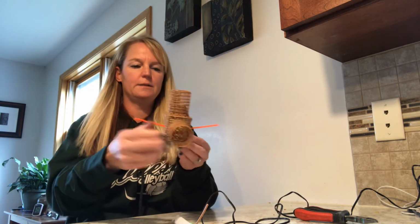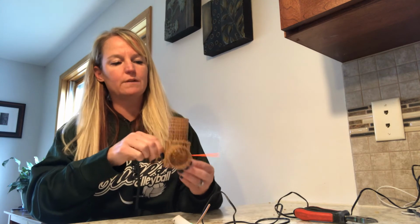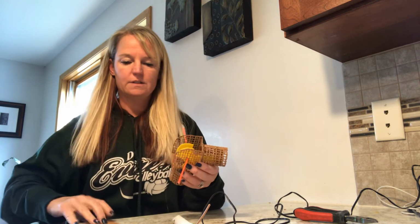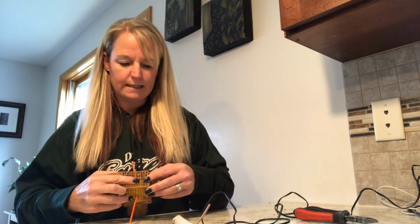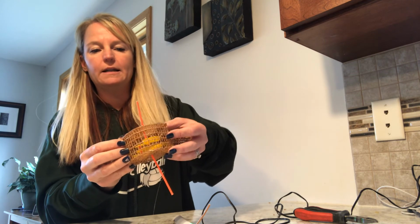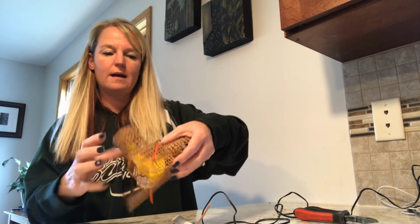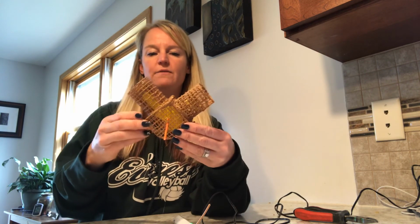And then you're simply going to test it to make sure as you turn your pieces that your piston heads are moving up and down and everything is moving from your crankcase. And if that works, then you simply take the bottom part, tack weld it on here, tack weld it on the other side right there, and then weld the entire thing together. All of your edges. All right, and there you go. You have just made yourself a nice little mini V-twin engine.